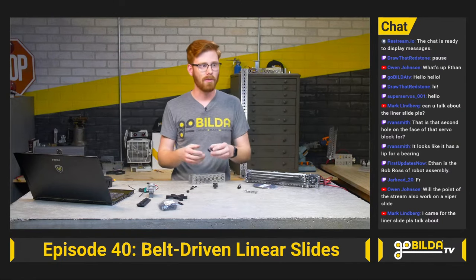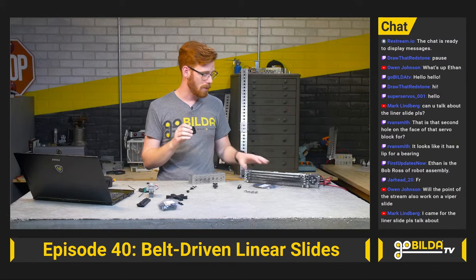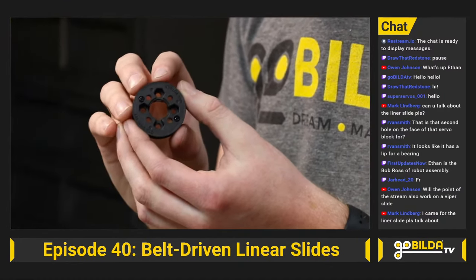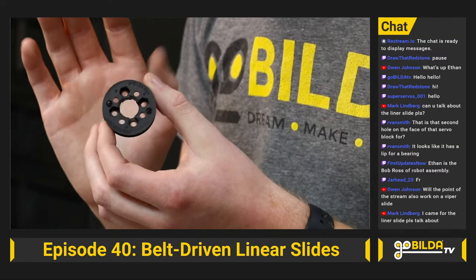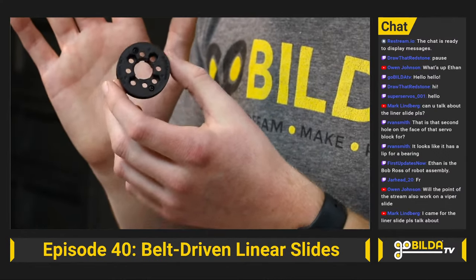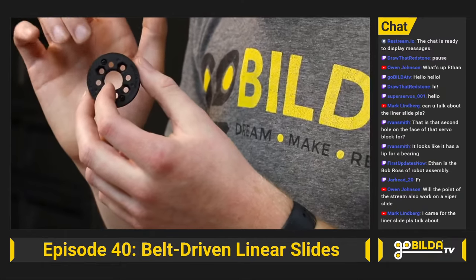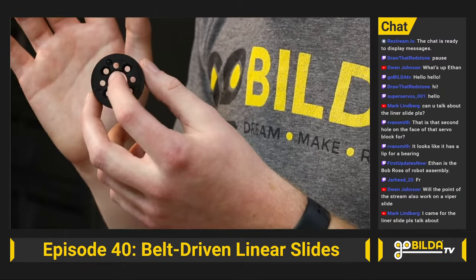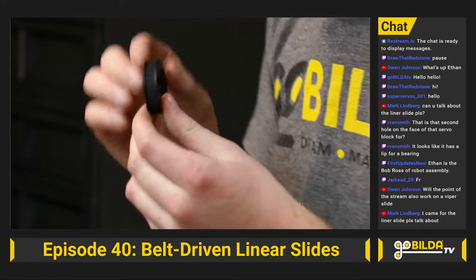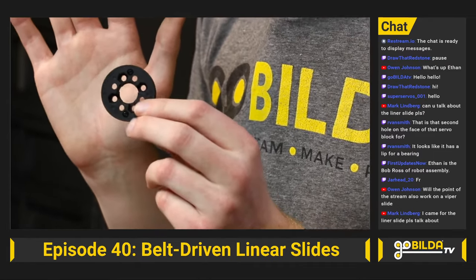The first part is the pulley — the first GT2 pulley we're launching. It's a 6mm wide belt at 2mm pitch, which we chose for this small-scale work. The first pulley is a 60-tooth hub-mount pulley with four counterbores on each side. It's designed not only to be hub-mount but also to capture bearings, making it really easy to have one idle on a shaft or standoff. It's 10mm wide, so two bearings' faces touch in the center. A 4mm ID bearing works great here since you can just mount it to a 4mm screw.